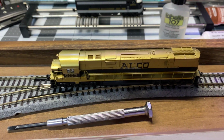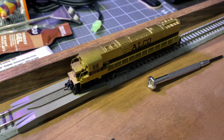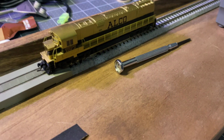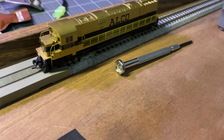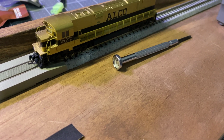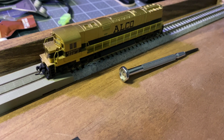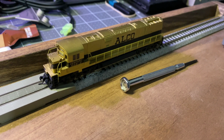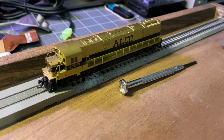But like I said, I think we're just dealing with possibly too much axial friction. I've tried to scrape and claw and clean out as best I could. It doesn't feel like it's a real tight fit, but you know, when you're dealing with thousandths tolerances here, it could be enough to not have any tolerance and thus providing a problem. So I'm done screwing with it. It runs, and I think that that's a victory.